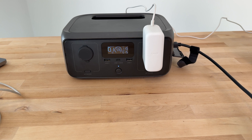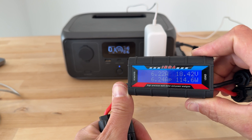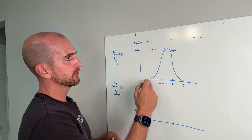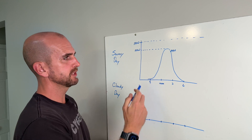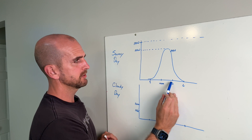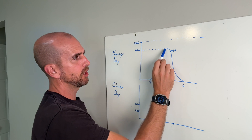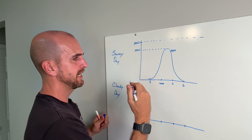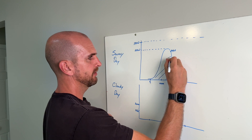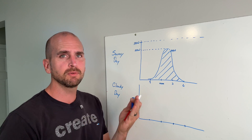As expected, we are now maxing out the solar input at 110 watts. The voltage moved up a little bit — we'd expect that to maintain — but current could only go up slightly because we're maxing out the solar input. If we look at a power curve across the day, in blue this would be if we just plugged in one panel: at 100 watts we max out. When we took our data point around 2 p.m. it was about 94 watts, already coming off the top of that curve. The energy we're producing throughout the day is the area underneath that curve, which is what we're putting into our battery and what we need to balance with our loads.